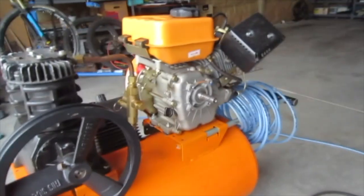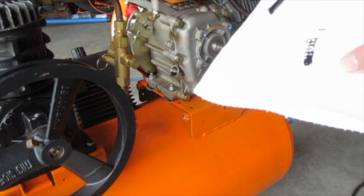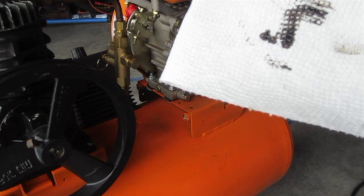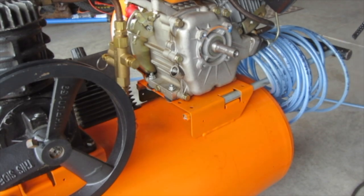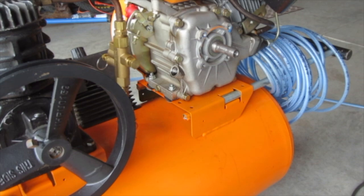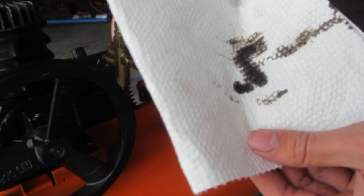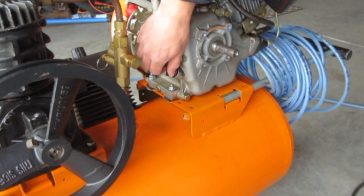Let's check the oil and see what we're dealing with. You can see it's quite dark. Keep in mind I did not run this a ton this past year — it's only been on this air compressor running maybe five minutes at a time every once in a while. Now, it is normal for oil on diesel engines to get dark pretty quickly because of soot that gets into the oil. So it's not actually as bad as it looks. You can see there's no metallic stuff, and that's what you want to look out for — if it's just dark, that's mostly soot, not metal shavings.